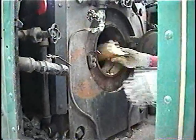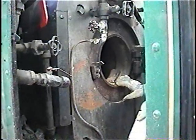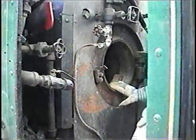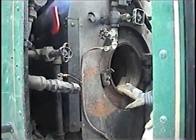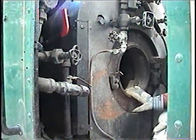this on the. Now, if we don't clean the ash pan, what happens? You don't get oxygen. You don't get good air, and you can actually burn out the grates because the grates will overheat, just being cast iron. They want that cool air coming up.